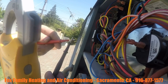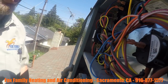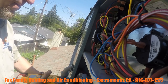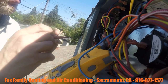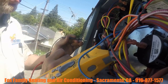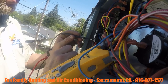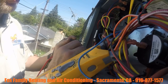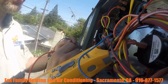So I'm going to switch my meter over to continuity and check for continuity. If my leads are touching, then I have continuity. What I don't want is continuity between any of these terminals here at the contactor. That's letting me know that I have some contact between the actual voltage wiring and the frame of the body — that's a direct short to the unit.